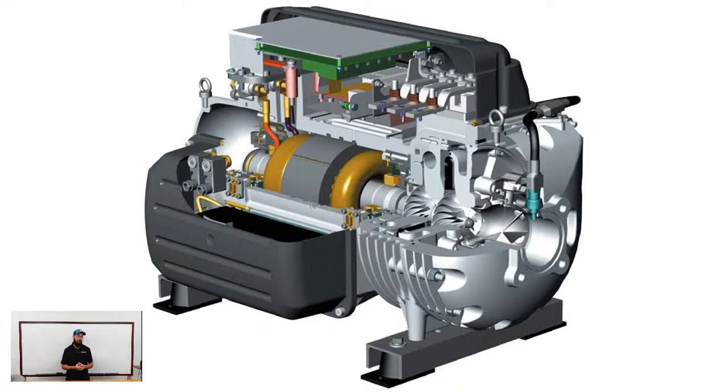The bearings. So you're asking yourself, okay, what do the bearings do? And this is where the term PWM, pulse width modulation, comes in. If there is one term that you should start to learn and become very familiar with across all kinds of sectors of our industry, it is PWM technology. VFDs are pulse width technology. We use PWM more and more on the automation and control side. There are a lot of systems out there, especially with SCRs, that use PWM control circuits in the cards to run them. You also have your mag bearings, which are pulse width modulated bearings.